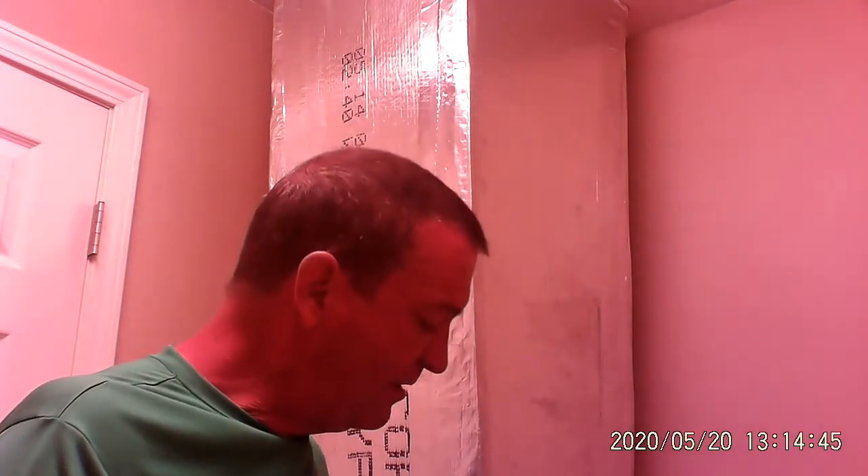It's furnace filter changing time. Now, how often are you supposed to change your filter? If you've got pets, I would change it once a month. Think about all that hair and dander that's going around inside your house, just floating around. Your air intake for your furnace sucks all that up into the furnace itself, shoves it down through the filter. But do you want all that hair and dander to come back into the house? No. If you've got pets, once a month. If you don't have pets, do it every season change.